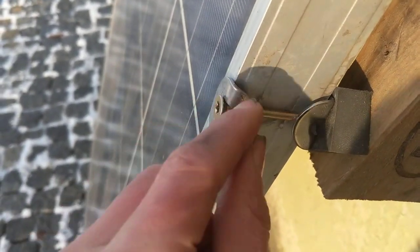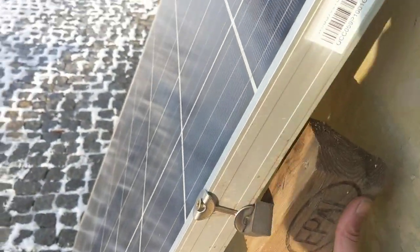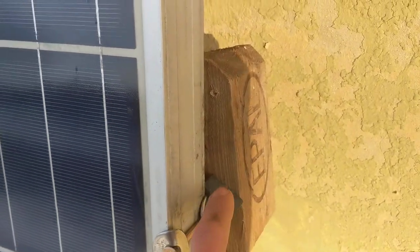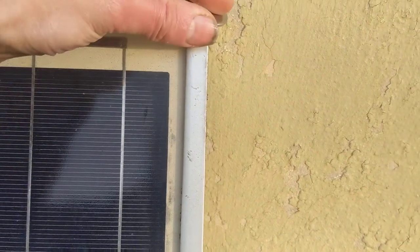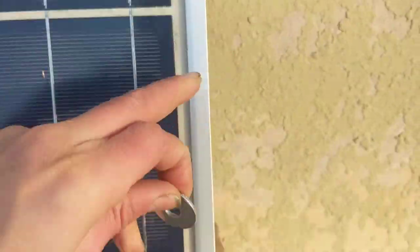These are very cheap — six millimeter bolts, about 14 centimeters long, with 30 millimeter to 10 millimeter washers. You can really pull it and it doesn't get loose. This rubber will last — it's not polyethylene or something — so for the lifetime of the solar panels it will not shrink and it's going to be tough. I'm even thinking if I mount the middle pins that way, I would only need one per panel instead of two.